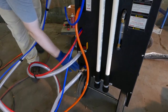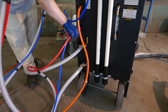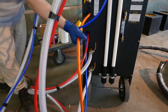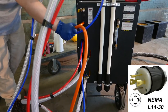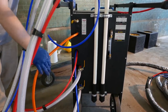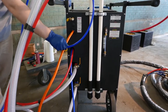On the back of the machine, A is marked in red and B in blue for the material inputs. These go directly into the pumps — this is where you're pulling from. There are also return outlets for circulation. This is a 220–240 volt system with a large cord. The connector is an L14-30 NEMA connector, with adapters available for dryer plugs. You must keep the neutral, because the system splits to two 120-volt circuits inside for the motors and cannot have a neutral-less connection.